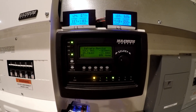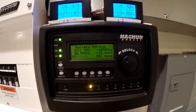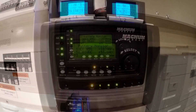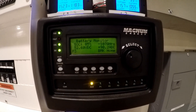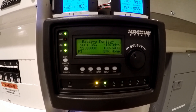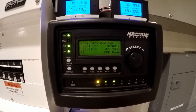It just kicked in — we hit 85% state of charge, and you can see the chargers ramping up: 45 amps and climbing, there's 90. We've hit 90 amps at peak at 52.8 volts, pretty close to 5,000 watts.